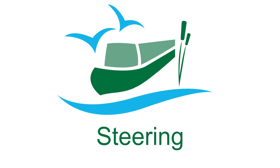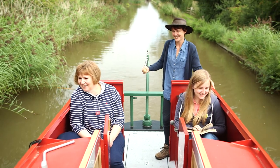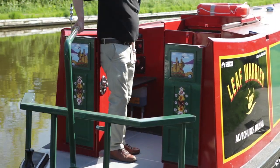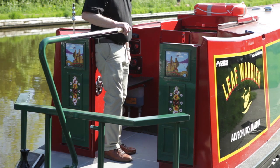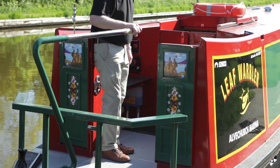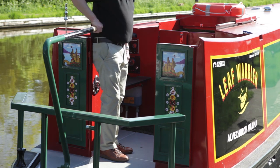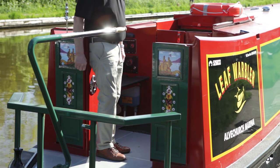Once underway, you'll need to steer the boat using the tiller. For some people this is sometimes not as intuitive as using a steering wheel in a car, because you do the opposite to what you might think. To turn the boat to the right, you need to move the tiller to the left, and to turn to the left, you move the tiller to the right. With a little practice, you'll soon get the hang of it. But the most important thing is where to stand when steering — don't ever stand within the area of the tiller swing. If the rudder were to hit something in the water, it could swing the tiller around with some force, so you want to be well out of the way if that happens.